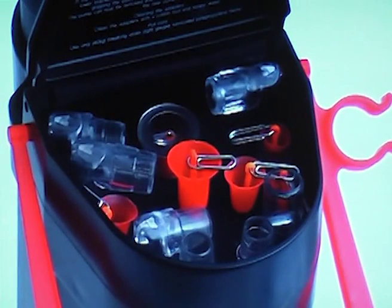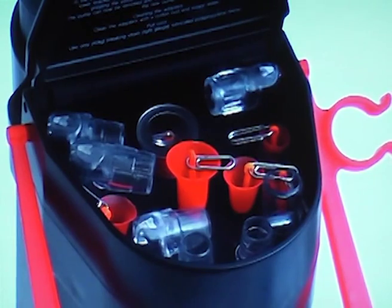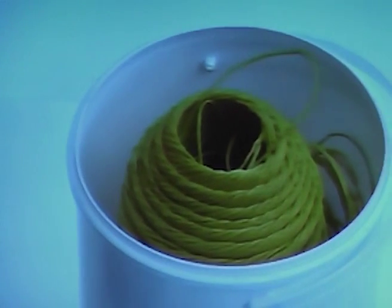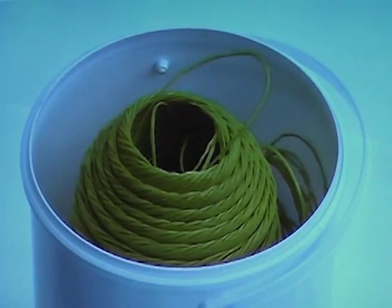The Wizard is supplied with a set of adapters and shuttles suitable for use with 20, 25, and 32mm rigid and flexible conduits. This product also includes a 900 meter roll of 45kg breaking strength lubricated pull cord. All spares are available separately.